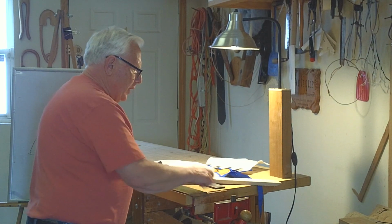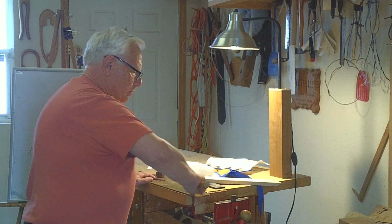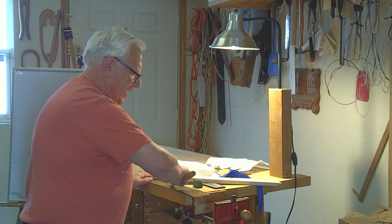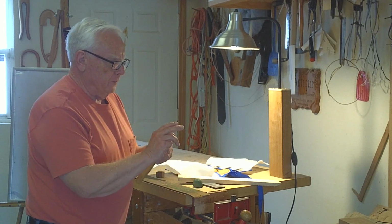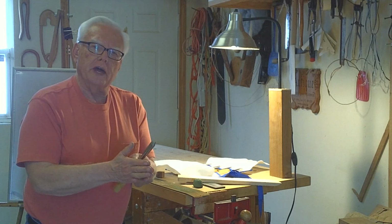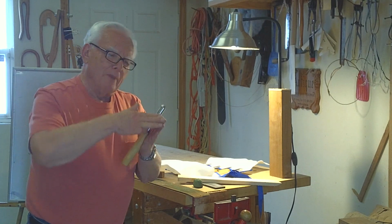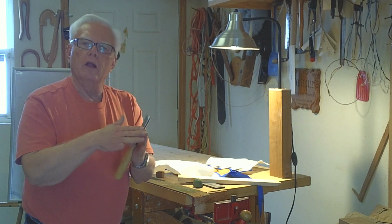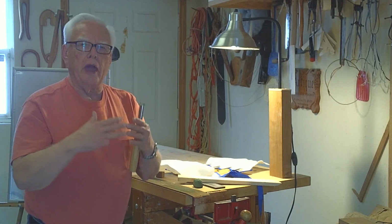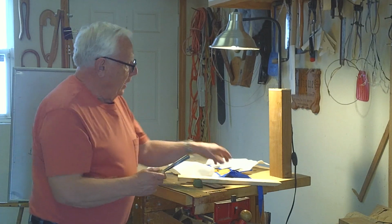And it's just like the razor strap that you buff your tools on to get that razor edge on it. And the angle that you're using your tools at is about 22 degrees. I like mine maybe a little bit higher angle, but 22 degrees is the average, and that's the one I'd recommend if you're starting off.